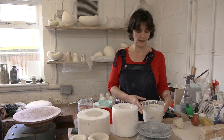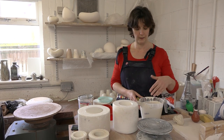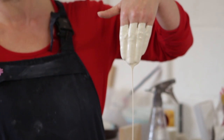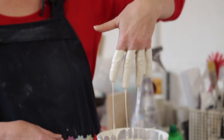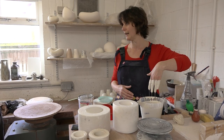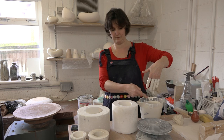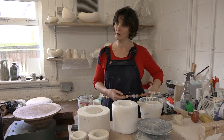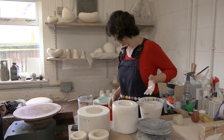What's really important about casting slip is that it's very liquid. You need to be able to have it run off your fingers and ideally make little duck's feet between your fingers — then you know intuitively it's about the right thickness. If it drops off instead, it's probably too thick, and if the slip is too thick you don't get a good cast.